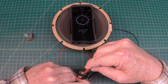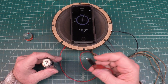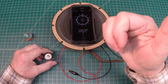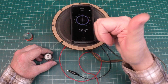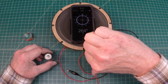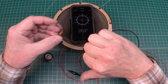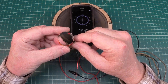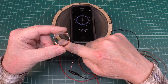You can see I'm getting clockwise movement. What that indicates, based on the polarity that we have right now, is that if you follow the right-hand rule, the current would actually be flowing in this direction. So facing the voice coil — or looking down at the voice coil — this would be your south pole and this would be your north pole.